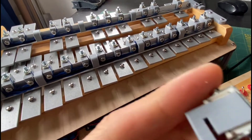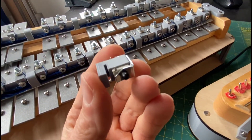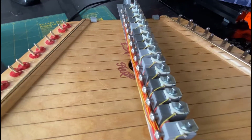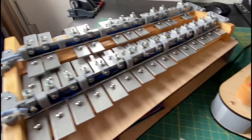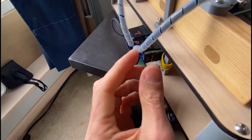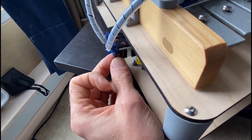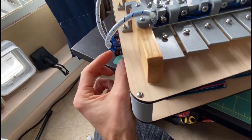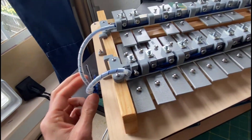The solenoids need two connecting points and there are small flanges on the solenoids to solder to, so I used some really small gauge wire for all of those connections. Those run down underneath the board to where the electronics are, and instead of having them directly connect I decided to create some connector points here using a crimping tool to make some custom headers. That allowed me to remove the entire top to service the bottom without worrying about the connections being disconnected.